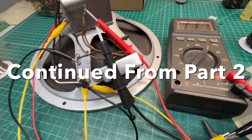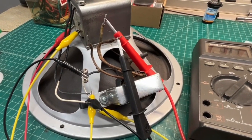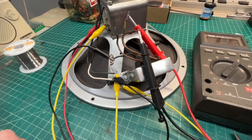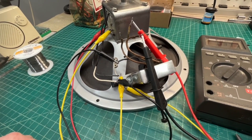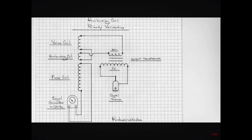I wanted to ensure that I have the humbucking coil correctly out of phase with the voice coil. You can see the pop-up in the right top corner of the screen, and if you're not seeing it, just check the video description — there's a link for doing so. I'm just using my signal generator and, instead of my signal tracer, I'm just using my multimeter.